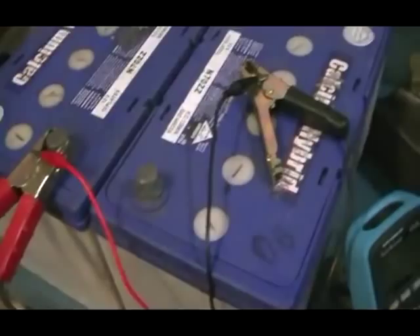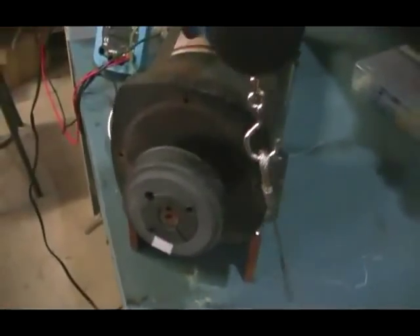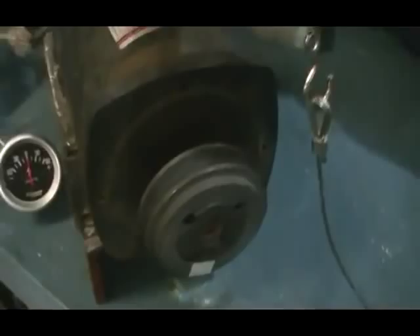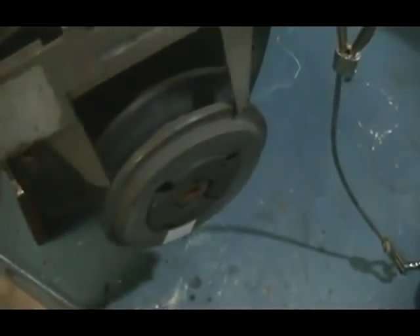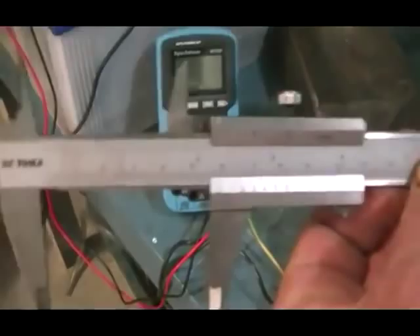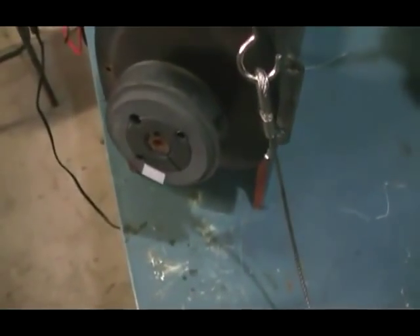This will indicate our battery voltage, and here we have two quite large batteries supplying our 24 volts. The other thing we have to note on this setup is of course the diameter of the wheel in which the rope will be running around — this is probably three inches. However, we'll be running the rope on the bottom of the V, as you can see I have already been doing, and that measurement there is 58 millimeters.